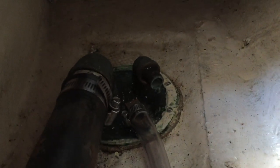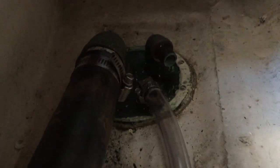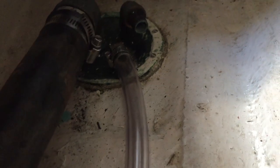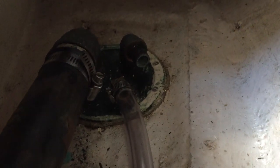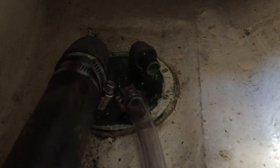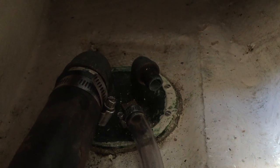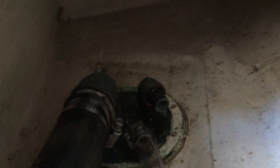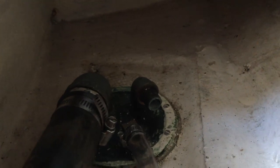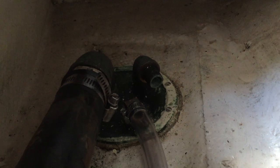In the v-berth this is our setup. The black hose is the fill hose; the clear one is the brand new vent hose — I got a clear one so when I'm filling up the tank and water gets into the vent, I know it's full. I also have a leak somewhere when I'm on a starboard tack it leaks into the bilge, but that's another day.